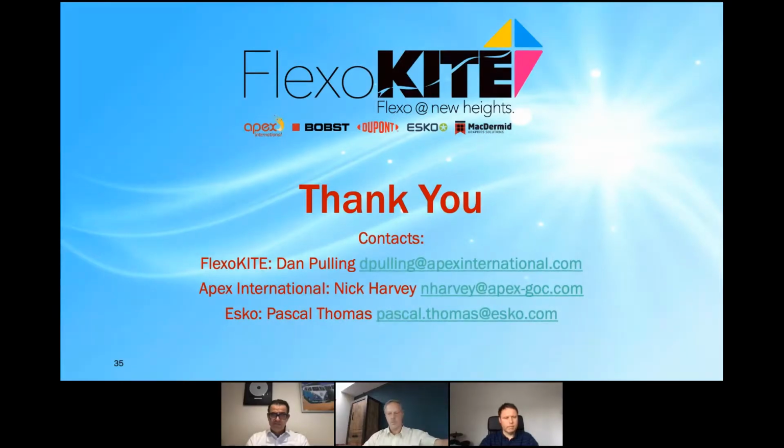Yeah, I can maybe take the first part of that, Nick. So from a screening perspective, as I mentioned beforehand and as illustrated in the PowerPoint, we have these 8 patterns which have been rounded down from hundreds of different options. And we look at pairing those individual patterns with different volumes and LPIs of ink. So that's the theory from a screening perspective. From Nick's perspective, I'll let you talk about the anilox side, mate.